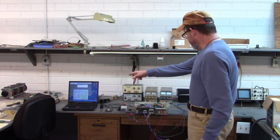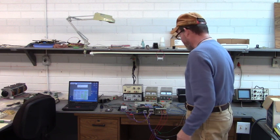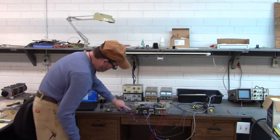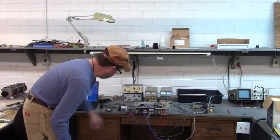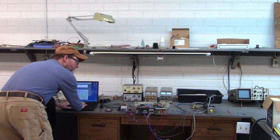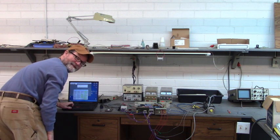The repairer uses this program over here to control the operation of the servo drive. Turn on the enable. Now we have power, run, and stop LEDs on. I'm going to click on the zero command. There we go — the new IGBT is working.